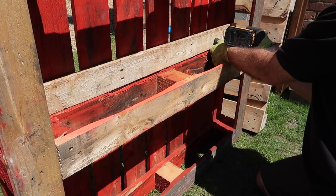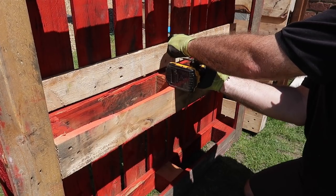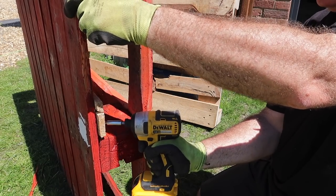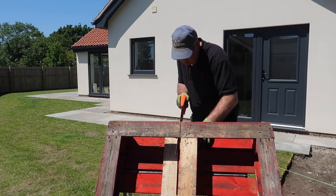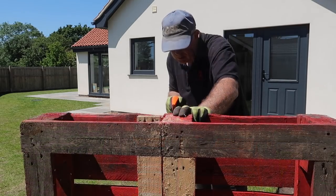I used the board as backing timber to one side of my biggest pallet, Big Red, and screwed it to each slat along its width, leaving just a 5mm gap between it and the central support. That meant that I could saw along this 5mm gap, essentially cutting the pallet in half, but just off-centre.